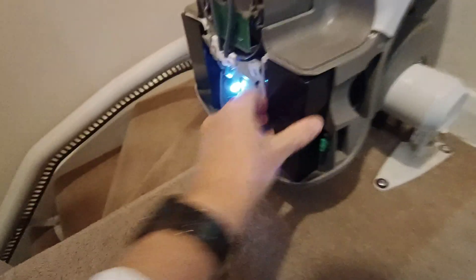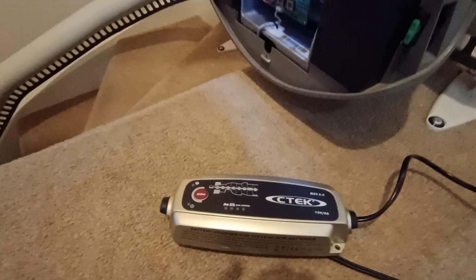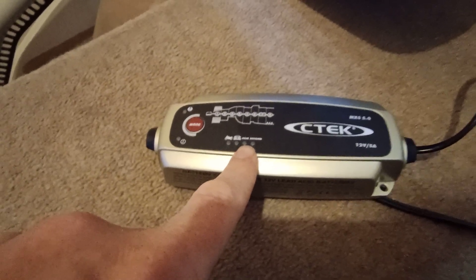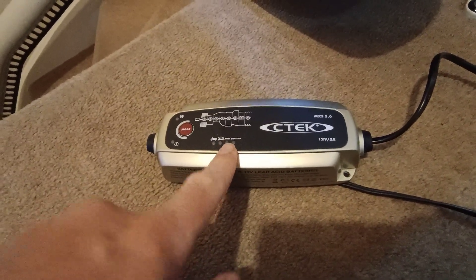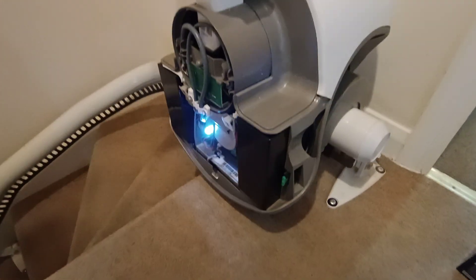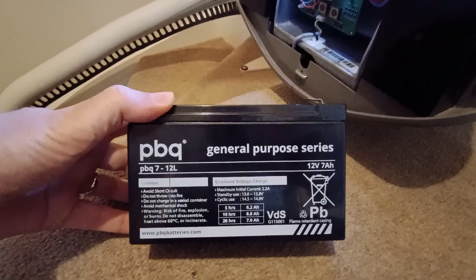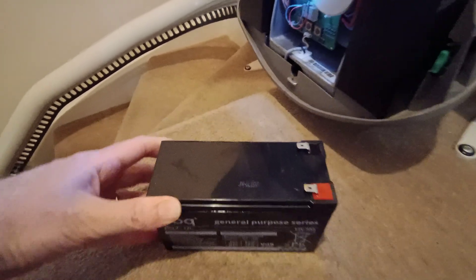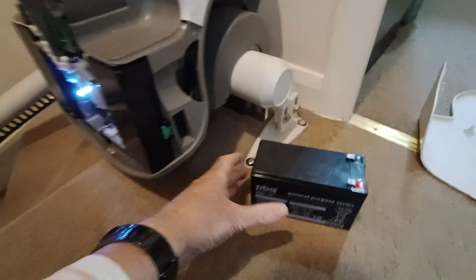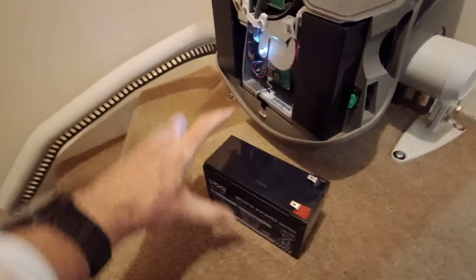Once I took the batteries out, I charged up one of the batteries with my CTEK 12 volt car battery charger. I could put it into car mode and AGM mode, which is for a gel battery. So they are sealed batteries, but there are two types of sealed batteries. You need to make sure you're getting an AGM, which is actually a cheaper battery. The point of the AGM is it gives you a greater current or power output at any given moment. These things do take a reasonable amount of power and you don't want to overheat your batteries because you've got the wrong one. This was the original battery, and I was able to establish it is an AGM battery. I found a specifications document for it - I might have a link in the description. It's 12 volt, sealed, AGM, and a 7-12 - or some people call them a 12-7 - which has to do with the dimensions.